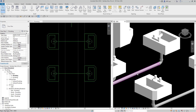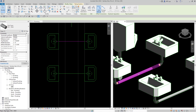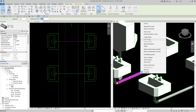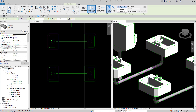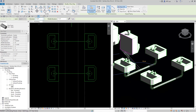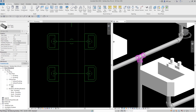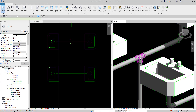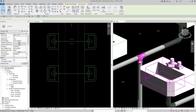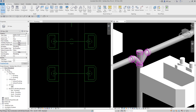I'm going to continue drawing in this 3D view. I can click on this piece of pipe — I know I want a vent to come up from it and also my sanitary to go down. So I right click, create similar, select the midpoint, and drop this piece of pipe down to maybe negative one foot, hit enter, and apply. Revit drops my pipe down. Now I click on the fitting and hit the plus button to make that a cross — Revit's going to use this combination fitting again.